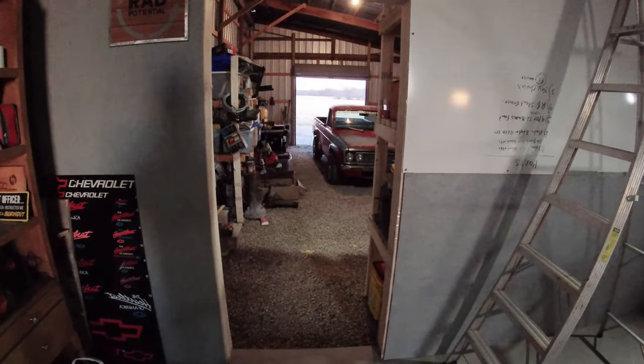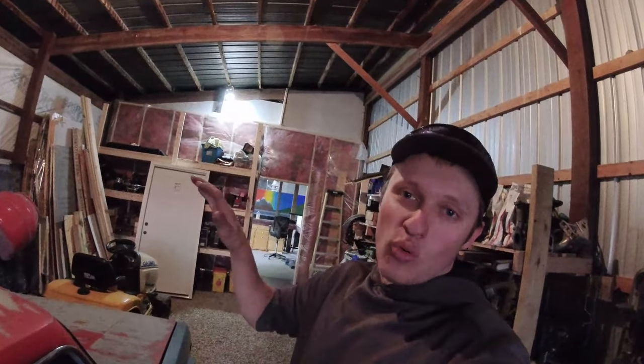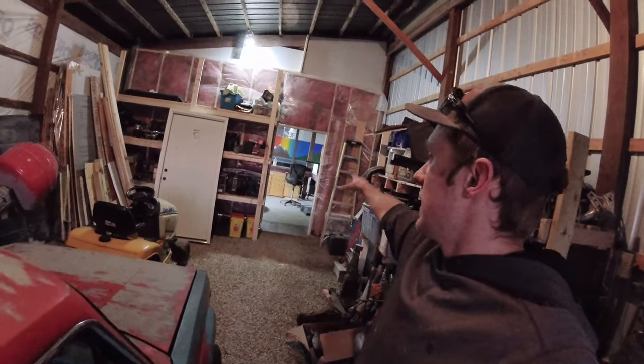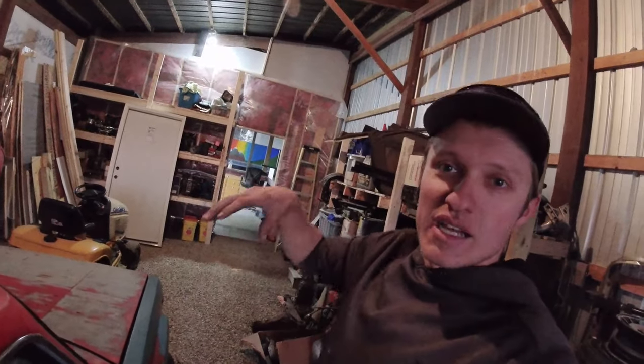This side I opted to leave as rock. The main reason is that when you're rehabbing a building from the inside out, you need to assess the existing structure and make sure it's worth it to pour concrete inside. One of the reasons I didn't want to concrete this whole side is that this lean-to was definitely older — the posts are a little less structurally sound, a little more rotten at the bottom. I only wanted to minimize my risk of investment by pouring a small slab over there that gives me an area to build engines outside of where the cars are parked.